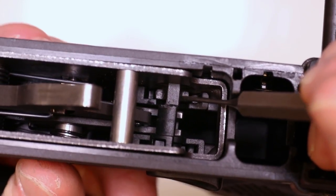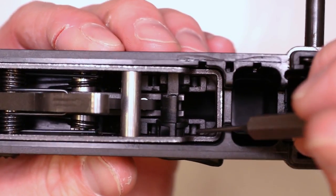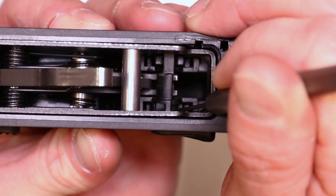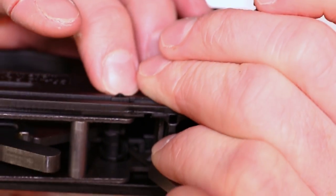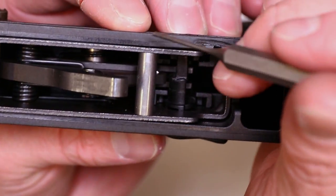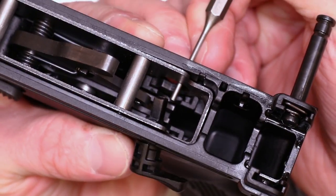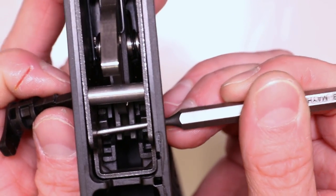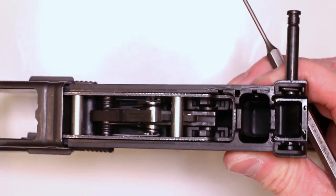You can see the detent right there — it's plastic. These detents are universal, exactly the same on both sides, so they'll spring away but they're big enough and easy to find. Now press down on the detent on the left side so we can get the rest of the safety selector out. You're only going to be able to press so far before you start hitting the punch, so take your 3/32 inch punch and follow through — push the whole thing out slowly, capturing those little detents. And there we go — fairly painless, a lot of hard lessons learned. Safety selectors are out.